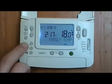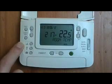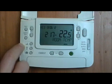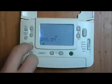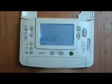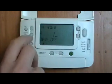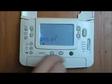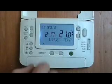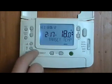Then we've got 2 others here. The top button, I think that's a deck chair, a bank holiday setting if you like, for when you're having a day off from work during the week. You press that button and what it'll do is set the Sunday settings for the days that you're going to be having off. So you tell it how many days you're going to be having off, use these buttons again to increase, click OK, and then for the Thursday and Friday it'll run the Sunday settings as shown by the little symbol there. Push it again to turn it off.